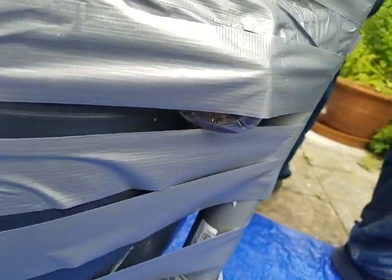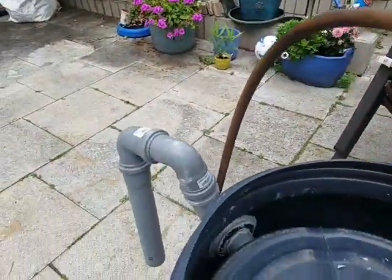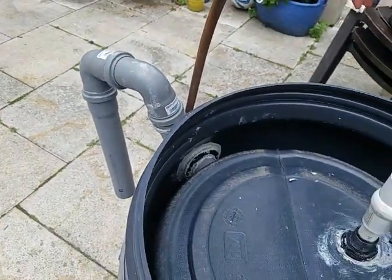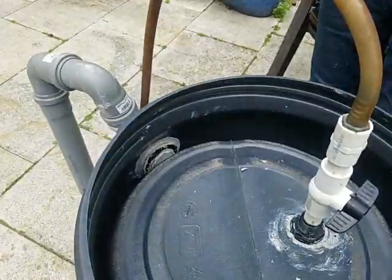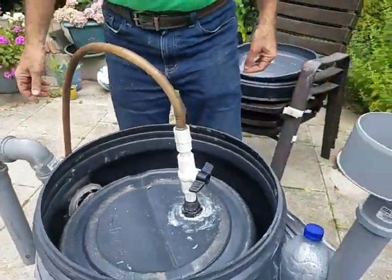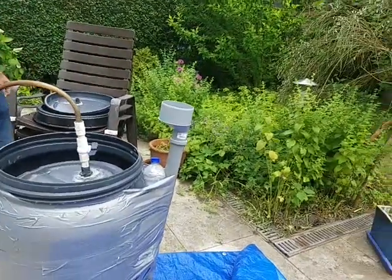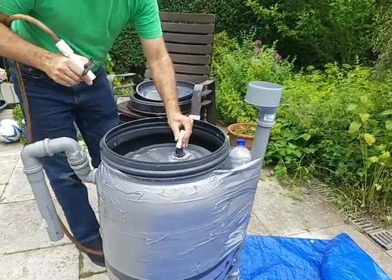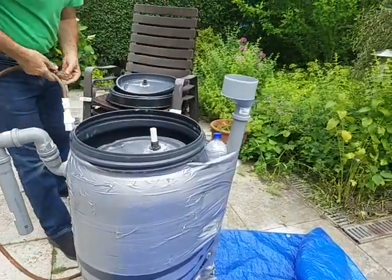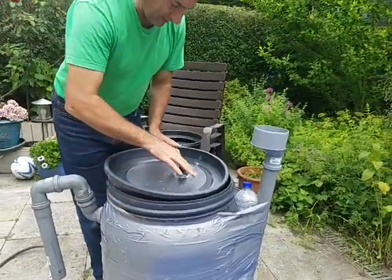Very hard to drill without making a mistake, which is why I've put so much silicone, as you can see, in there, because they're very thin-walled. Not the best for using uniseals, but this should work. Hopefully we're going to get some pond muck, some duck pond muck to fill it up with today, and then we'll let it ferment. And then, as I say, you have the option with this design of using it as a floating drum digester or sealing it like this.